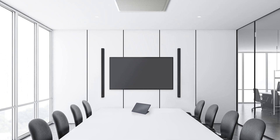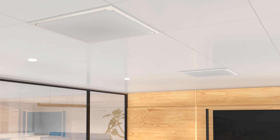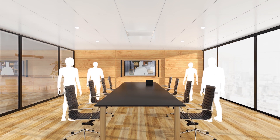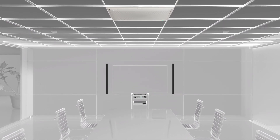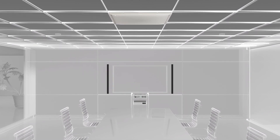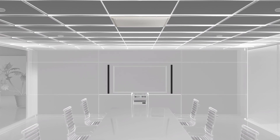Next, let's look at installing the RMCG in conference rooms that have drywall ceilings, as well as rooms that have a grid-type drop ceiling. Make sure to watch these step-by-step instructions first and review your building's ceiling plans before installation. Properly assessing the RMCG's mounting procedures, placement away from constant vibrations or noise like from HVAC units, and orientation related to the ceiling structure and railings to avoid any obstructions, will ensure that your system can be safely and securely installed before making any permanent alterations to your ceiling.